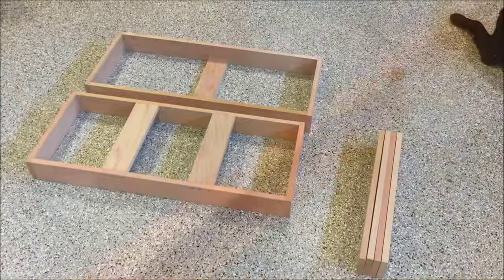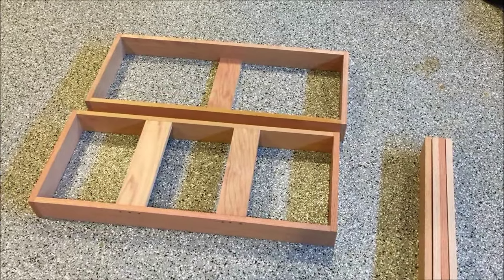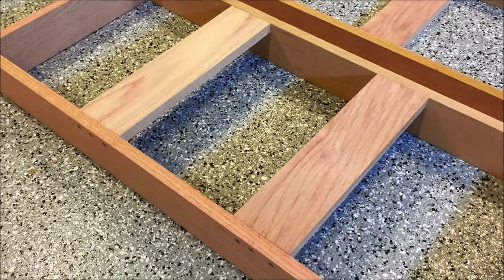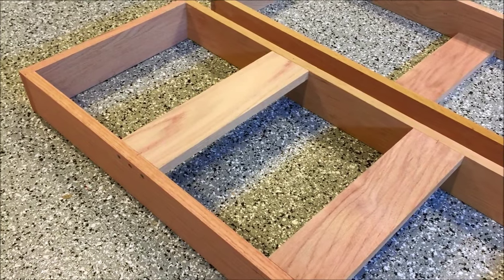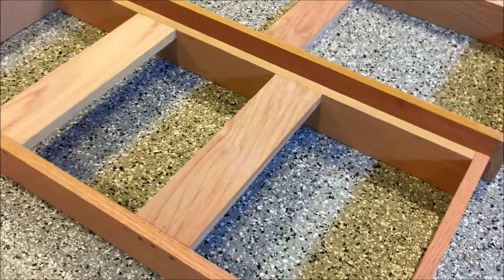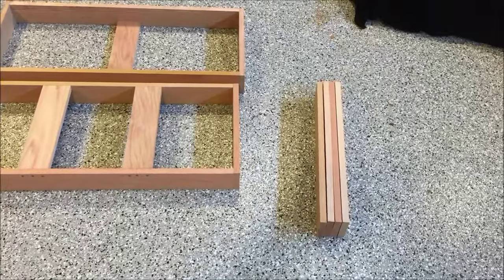Time to start with my cuts. A lot of the cutting is done — I went ahead and built out the top and bottom frames and the legs. I want to attach the top and bottom together using pocket holes so I get a nice flush edge. This will be an acrylic tank, so I plan on putting a piece of plywood on top. Those are just center supports — it should be more than enough to support the weight, because the external paneling will also be part of the support. This is just the internal framework, and we'll have additional support from the external paneling that sits on top of everything.